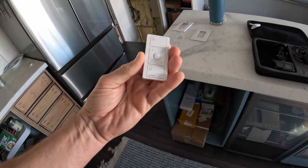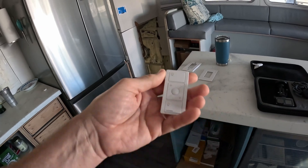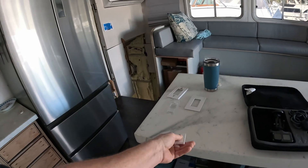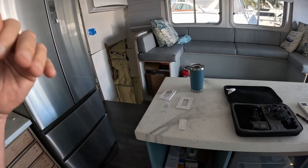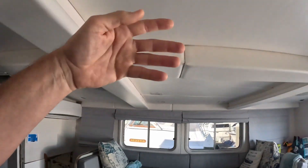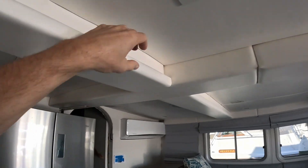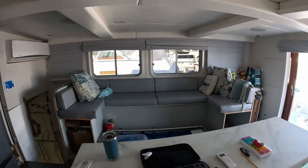That would be really cool. But the catch on these things is they're designed for AC systems — you pair this with a switch in the wall and make it a three-way switch. There are capabilities like a little hub where you can push a button and trigger a scene that turns on two or three lights. All cool. But I don't have AC lights. All these lights are LED digital 12-volt lights, and some, like our accent line, are RGB. The newer ones we're putting in below are going to be both RGB and white LEDs.